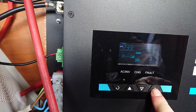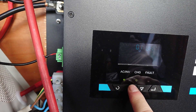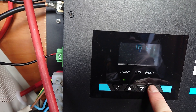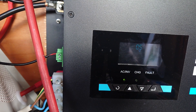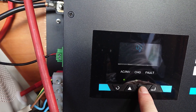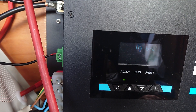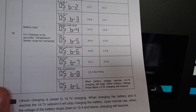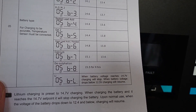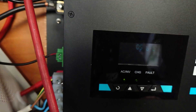So: parameter setting key, then we go one, two, three, four, five — B1 — and then we go down to BL. When battery voltage reaches 14.74 volts charging will stop; when battery voltage drops below 12.5 volts charging will resume.